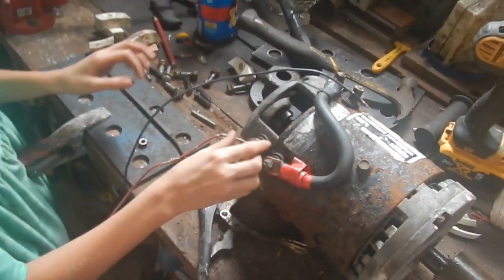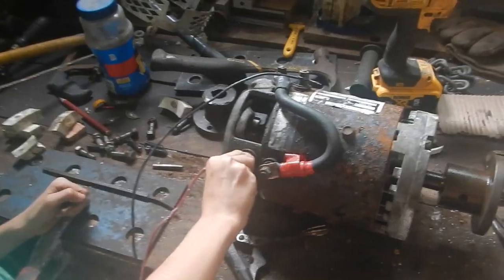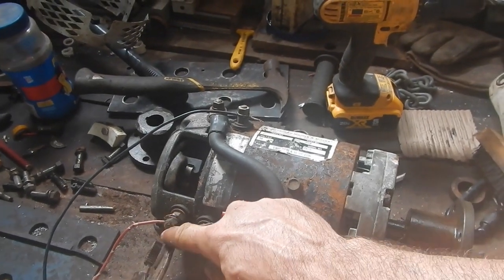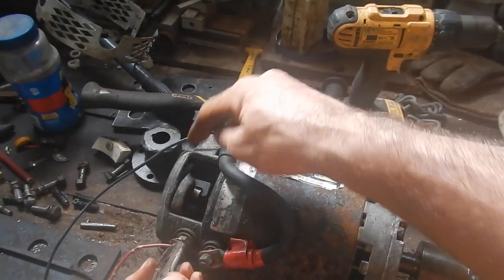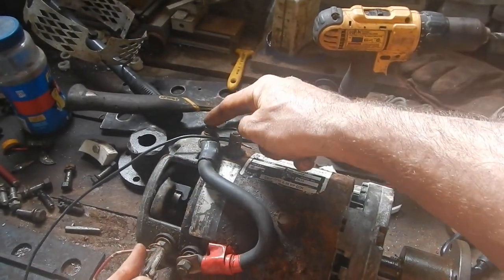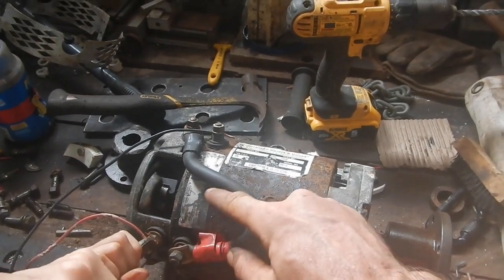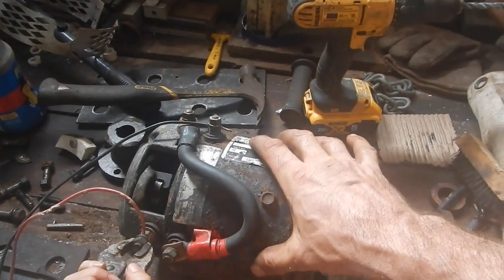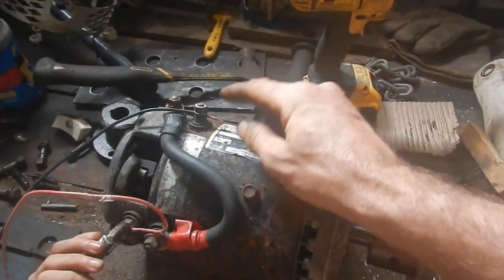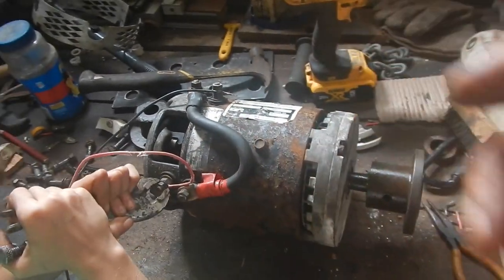The way this kind of motor works is you put the electricity in and it goes across the brushes, which gets the electricity into the middle part — the spinning part. Electricity comes out here, goes through here into this part, which makes the electricity go into the housing electromagnet and then comes out here. So with this wire here, the electricity goes through both things and energizes everything.